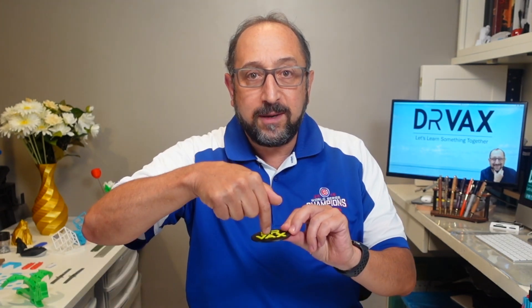While in concept it's very simple, in practice it's a bit more complex. In order to change the filament, I really need to move the print head from where it's currently pointed to somewhere away from my print. And it needs to be high enough above the print bed that I can extrude out the old color filament so I get the proper new color.